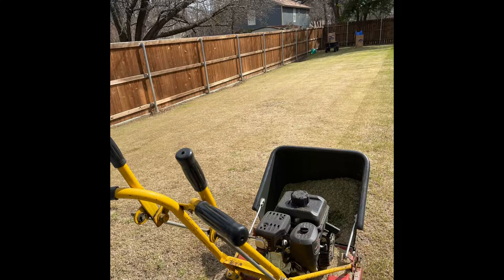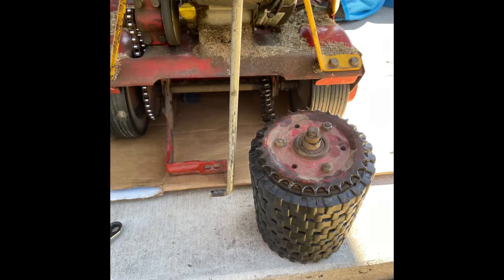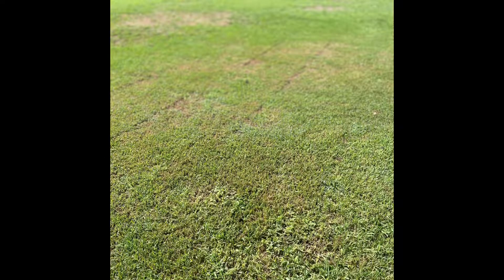So why did I sell my McLean? This spring, I was doing my spring scalp and blew the chain off of it. Had to wait a while for the part to come in. Once I got the chain in and got it all put back on and continued with my spring mowing schedule, I started noticing the thing started hard edging — where one side almost looks like it's missing a strip, leaving a hard line in your lawn. You get a double cut, maybe even a triple cut to try to alleviate it, and I started chasing down that problem.